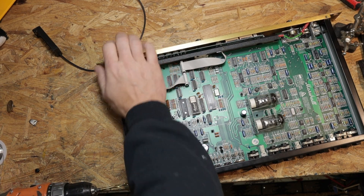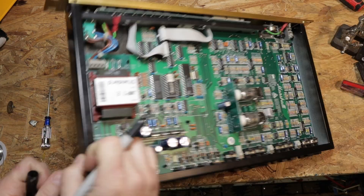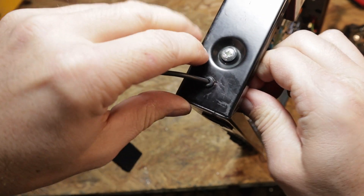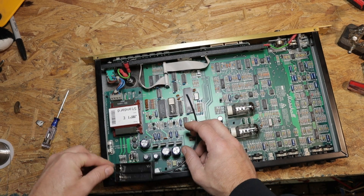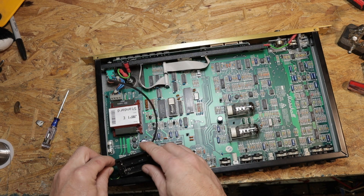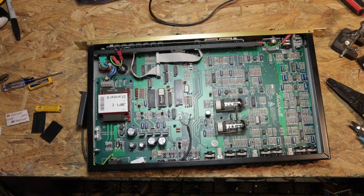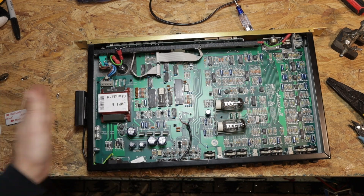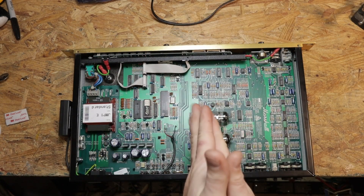I don't want to see any holes on the back of the chassis, and I'm also going to use a small grommet in that hole. That looks really good - that's our hole with our grommet in there so the wire can pass through and it's snug. It doesn't have a lot of slack so it won't get cut there. If we leave enough slack on this wire, we can Velcro it to the side or to the top of the unit and still be able to lift it off, change the battery out, and put it back without having to disassemble the unit again. Our battery pack is mounted firmly on the side, wiring secure. We've converted it to 120 volt operation - now let's see if it works.